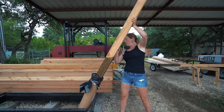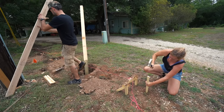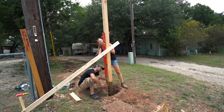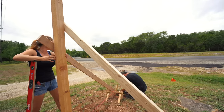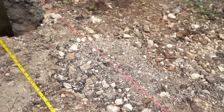After dipping a post I would set it aside and let it dry, then move on to the next. Now let's actually start setting the posts. One of the most important things to set up with a fence or anything you want straight is a string line. This runs from the very end point of the fence to the start and is set one inch forward from where the post front needs to end up. A lot of times you see people butt the object directly against the string line, however you run the risk of slightly bumping and altering it as you work down the line. By having an offset you completely cut out that chance. When positioning, we set the face off of the string line by one inch exactly, and I'll tell you now that this fence came out extremely straight.